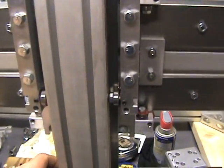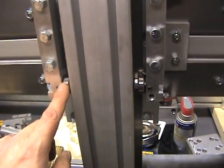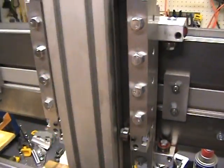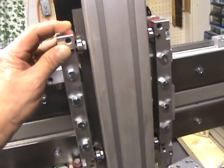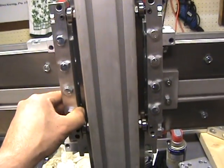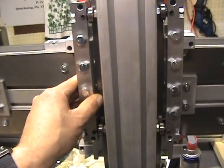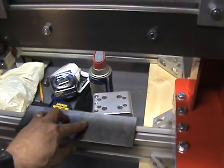After that, you need to bring it down so you have full contact on all bearing surfaces. From there you can work the tension on your adjustable bearings, and then you basically have to clamp the two extended carriages together to get some tension on the side rollers. I still need to do some adjustment here. One of the things I did to get vertical alignment was to use one as the fixed bearing block.